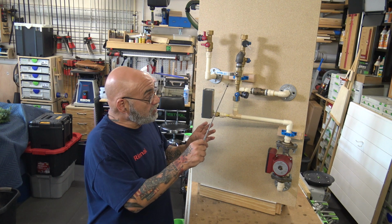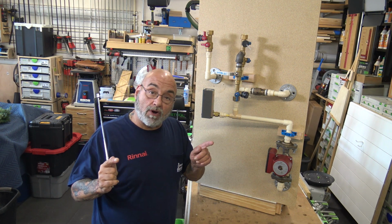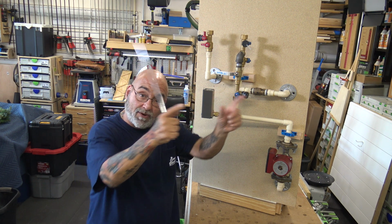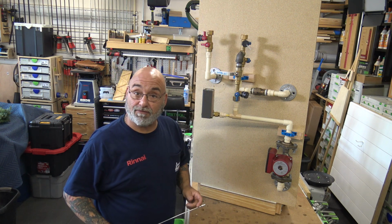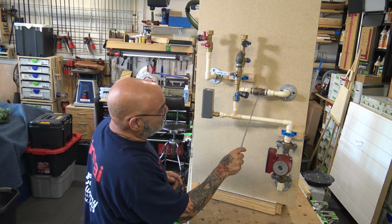Remember, if you're going to even use 2 check valves, so you're going to use one here and one here, arrows point to the tankless. The Indians are shooting arrows at the fort. The tankless is the fort. Okay? All right, so cold water from the house, check valve.